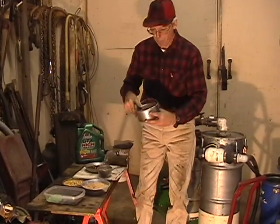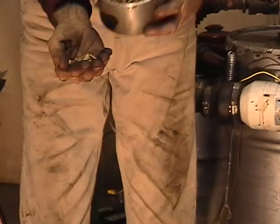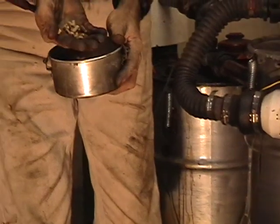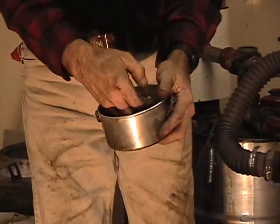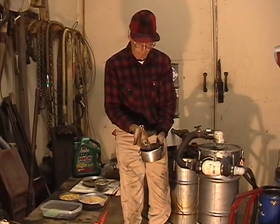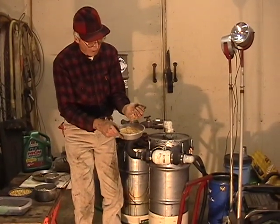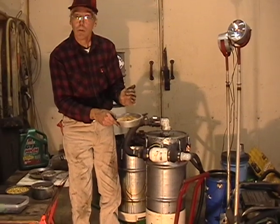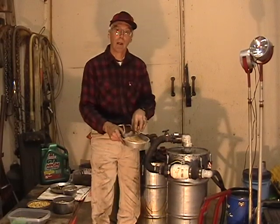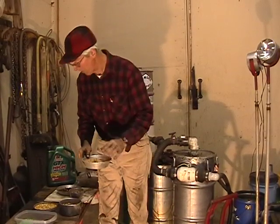Well, if I don't have wood chips, I can use wood pellets. I've used these very successfully in this unit. These are made up of pressed sawdust, so they're a high density fuel, but wood pellets don't work well in wood gasifiers, but they do work well in this type of charcoal gasifier. I have used sawdust. The problem with sawdust is it's a very low density fuel, but if I can get it moving through the auger into the wood gasifier, it does work because it also has the hydrogen. It's just the density is not there.